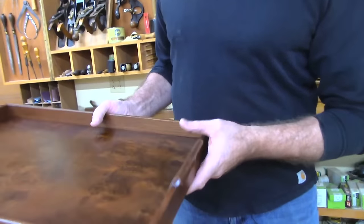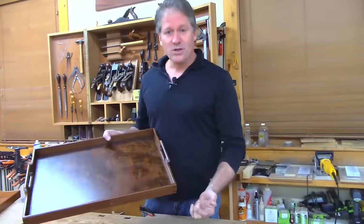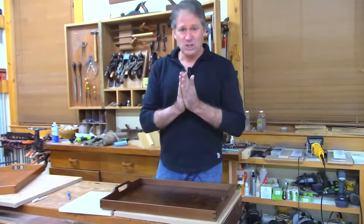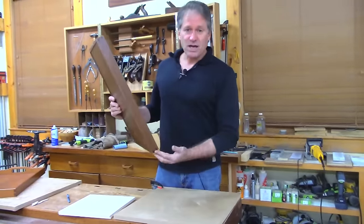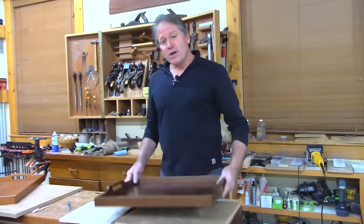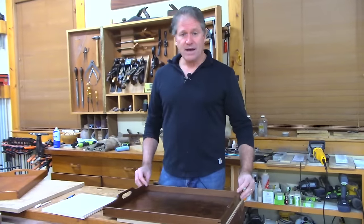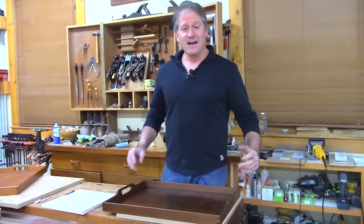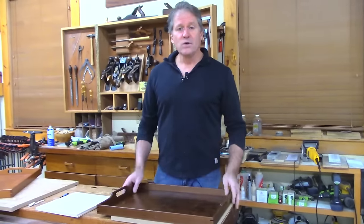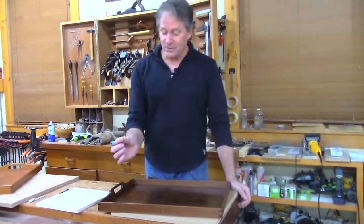On the outside you can see how I undercut here so it's curved on the walnut into the handle — that required some figuring out. When clamping up mitered corners it can be a challenge. My plan was to miter all the corners, glue in the base, clamp it up as a flat butt joint, and then put in the splines afterwards for strength and rigidity. But when I did a dry run, I wasn't comfortable with how it clamped and it was slipping.